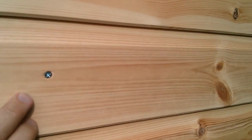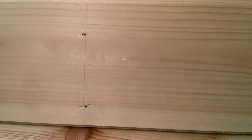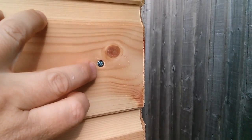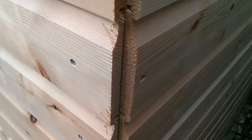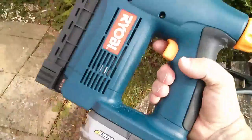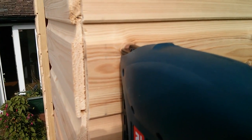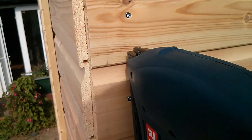Where I attach the cladding boards, I actually screwed it at both ends with screws, and then in the middle I've used brad nails with a sort of low-cost nail gun. I'm almost considering taking these screws back out, because there are a lot of them and they don't need to be there once the panels have been nailed on. So this is the brad nailer, one of my beloved Ryobi power tools. I'll just make sure I hit the side frame upright, not the front frame upright. Oh, something fell off the roof — just something holding it on temporarily.